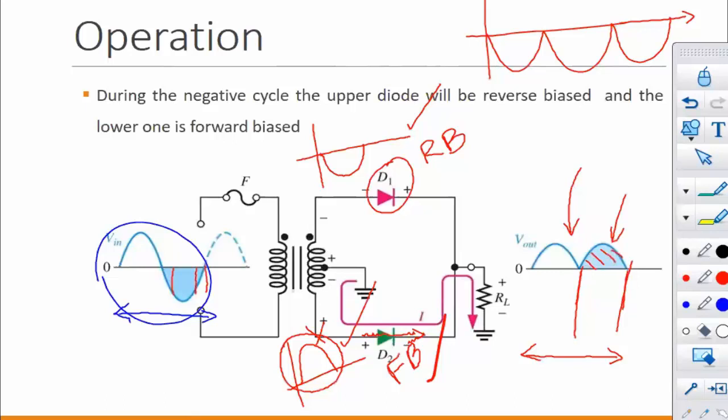A rectifier allows current in one direction. It can't change direction. After the rectifier, it is only one direction of current. That's why when you're doing AC to DC, DC is only one direction. So rectifier means it's going to allow only one direction. Whether it is like this, that's only negative. When you say this, that's only positive, not both.